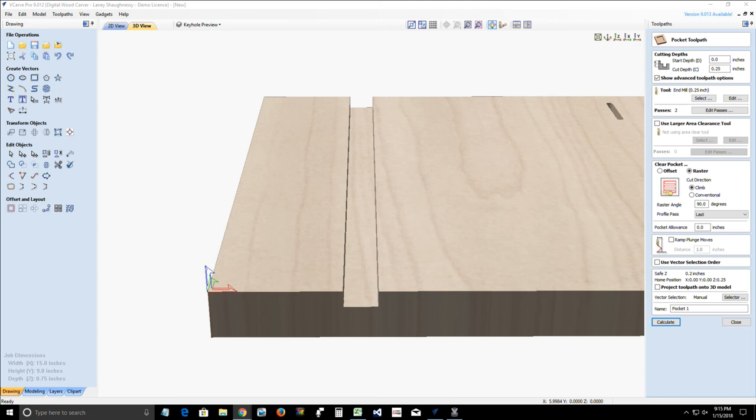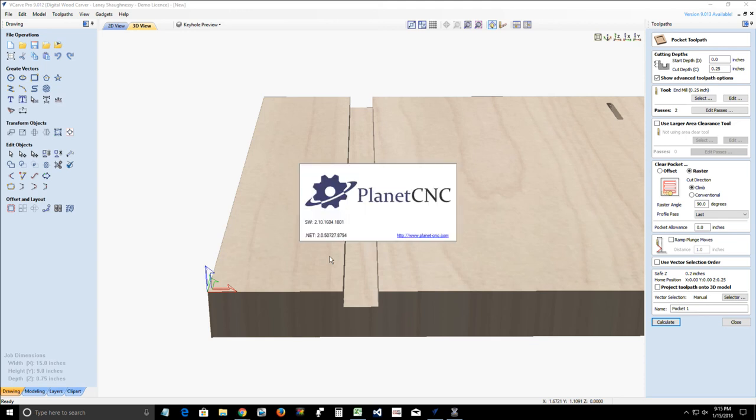MK34 board. Debbie, you would have to go to your CNC controller software and go to the help. You've got to be plugged into your CNC at the time. If we open up the CNC USB controller program, go up to help, activate license, and look at your serial number, it should say something like serial number MK34.